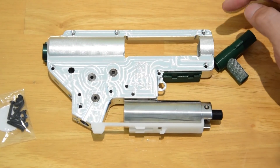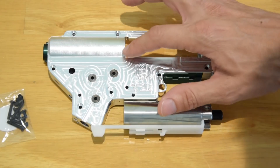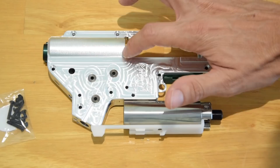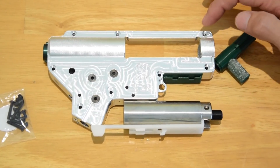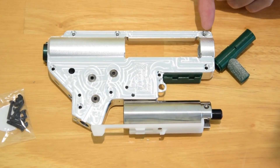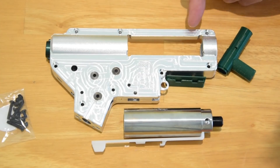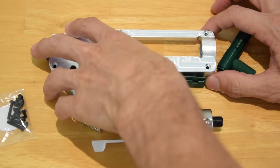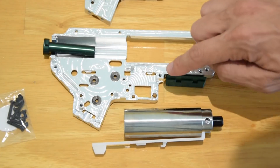You can also see on this box that it has been radiused in the corners. I made a video not that long ago about why that's a thing — it removes the single point of stress from a right angle, which inevitably becomes your failure point. I also like that there are no screw holes along the top piece here. I've seen gearboxes where they've got a screw through there — that's a bad idea because it breaks. And looking inside, it is dowelled as well, so when you pop the two halves together they lock into place and don't move.